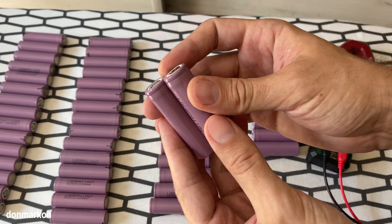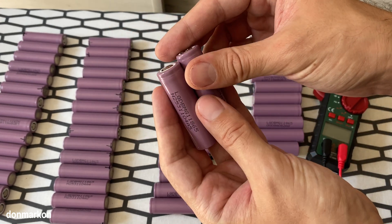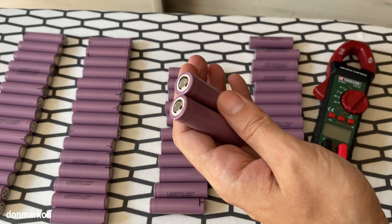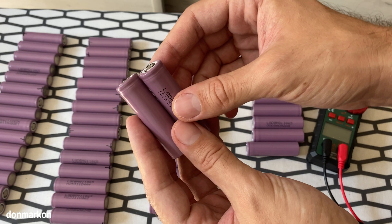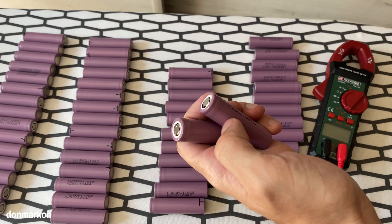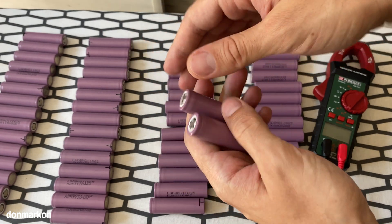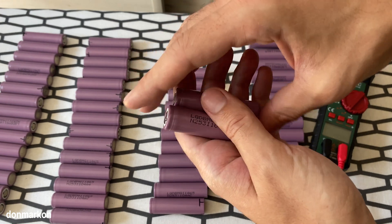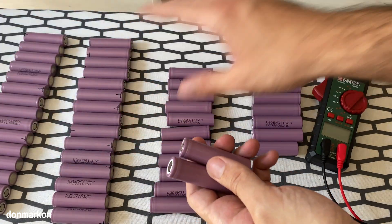Always keep testing. If it happened like with these cells that they were sitting for a prolonged period of time — who knows how many years — without charging, without anything, the crystallization in the cell just makes it impossible to charge. I did try to force-charge many of these cells which had no voltage, but they won't accept voltage above 2 volts, and when you disconnect the charger, the voltage drops immediately to under 0.1 volts — that's unusable. So just be happy if you manage to salvage any of them.